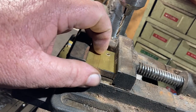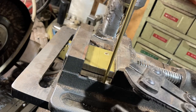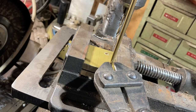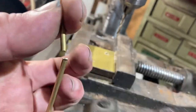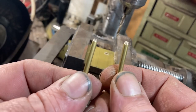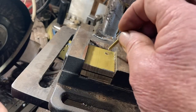My copper alloy is still a bit grabby, but it's nowhere near as grabby as copper itself — copper can really bind up the drill bit. For the pins I just use some eighth-inch pin stock, cut it a little bit above the jaws of the vice. I'll cut this one too while I'm there, and using the grinder I put a little chamfer on the end of them — it just makes it easier for them to go into the holes.